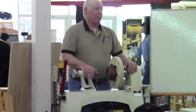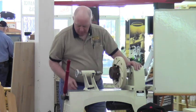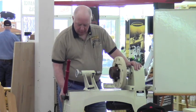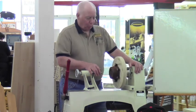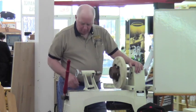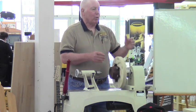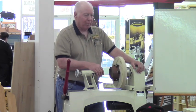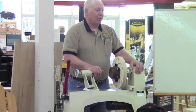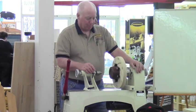Longworth comes from a guy's name that developed it. He was an Australian woodturner in the mid-80s. He came up with this little device that allows you to hold bowls on it. This really comes into play when you're turning the bowl and you have to finish the bottom of it. There are all kinds of kludgy ways to mount the bowl blank on the lathe, but this is pretty elegant, works real well, and it's continuously variable within a maximum or minimum limit.